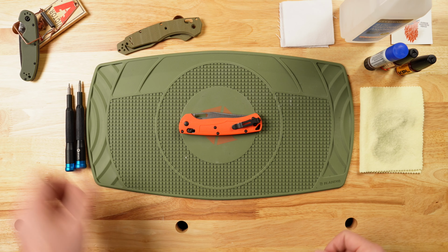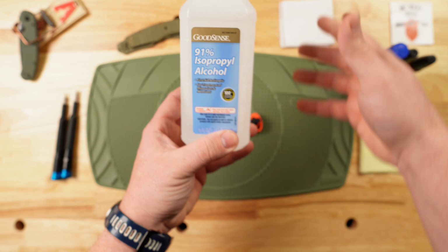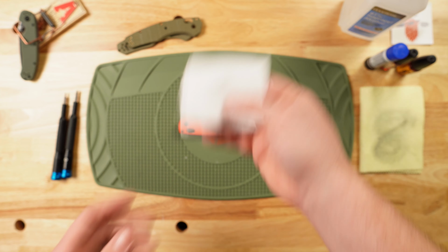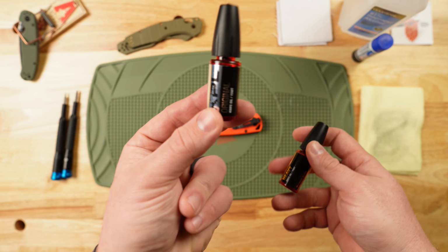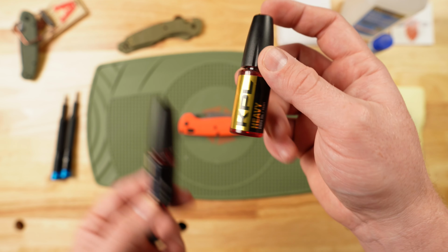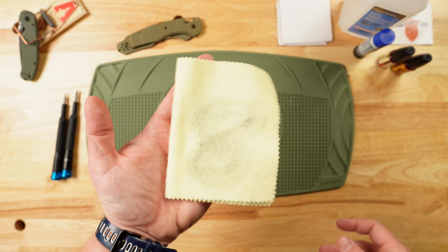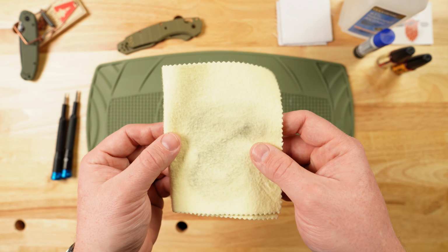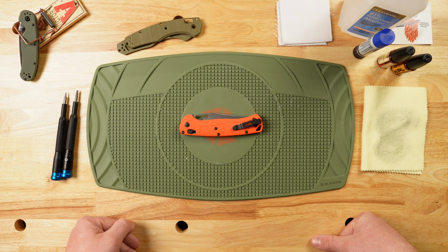Here's what you're going to need to do the job. You will need a T6 and a T10 Torx bit, some rubbing alcohol for cleaning, cleaning swatches, a little bit of thread locker, then a good lubricant. I will be using KPL Original 15 weight and the Heavy 75 weight to lube up the Omega springs. And then this is a little Sunshine Jewelry polishing cloth, and I'll show you what that's for later on. As many of these items as I can are linked down in the description for ease of purchasing.